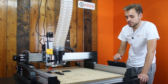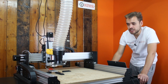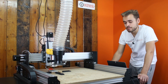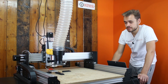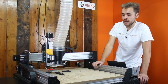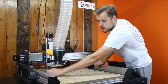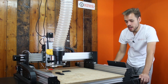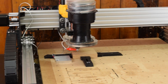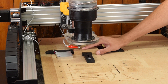For instance, I can just run the Z-touch probe by using Macro Zero and pressing Zero on Universal G-Code Sender. So I'm going to use the Z-touch probe under the Macros tab. Now it's running the Z-touch probe and that has been completed. If I remove the touch probe and then press Return to Zero, you can see it has found the surface of the material.